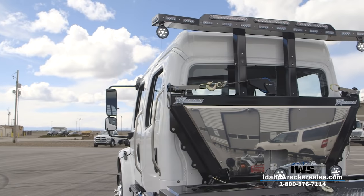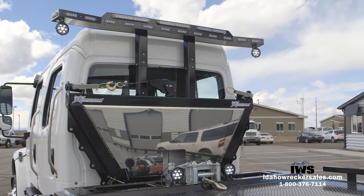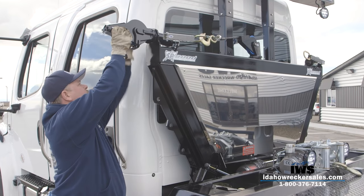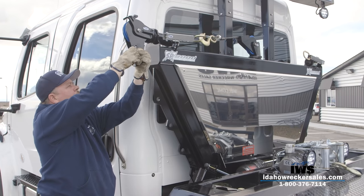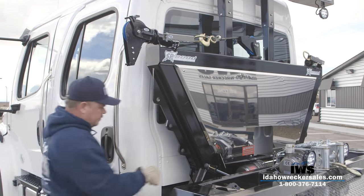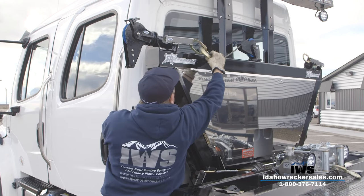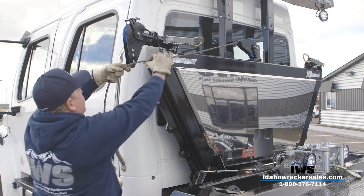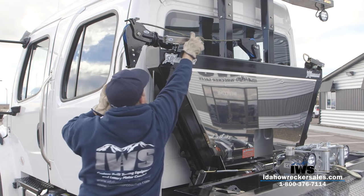As we transition to the main properties of the side puller — the recovery side — I'll take a moment to show how the Revolution Boomhead by In the Ditch is easily and properly installed. Setting up to use the removable boom head is very simple. Simply remove the wire rope guide by depressing the retainer clips, pull out some extra rope, place it in the Revolution Boomhead, and reinstall the clip assembly. Your wire rope will be secured within the Revolution Boomhead and it'll be ready for use.